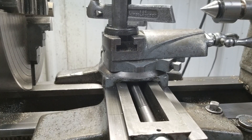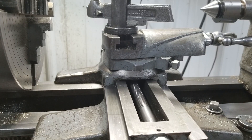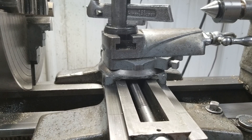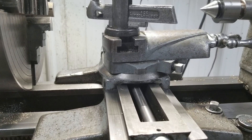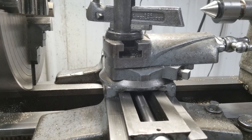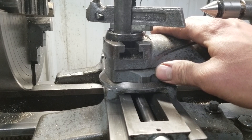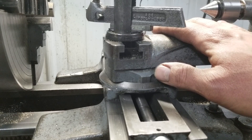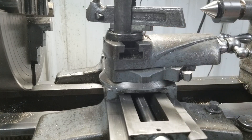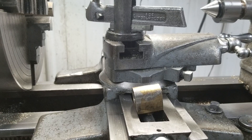Who turns it that far anyway - that's probably why there's a brand new thread over there. But for the most part, it's good. We reduced the 20 thou backlash to just under - let's see here - it's turning so good - like 5 thou at the most. There's our old one. Alright folks, thanks for tuning in. You guys have a good night. Peace out.